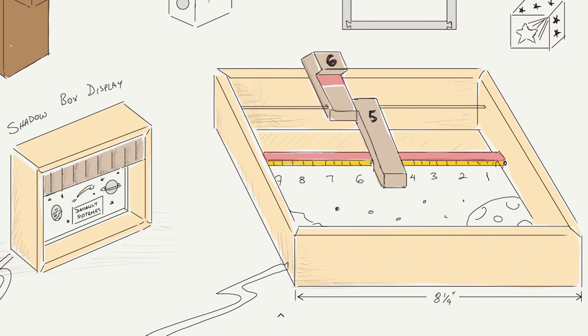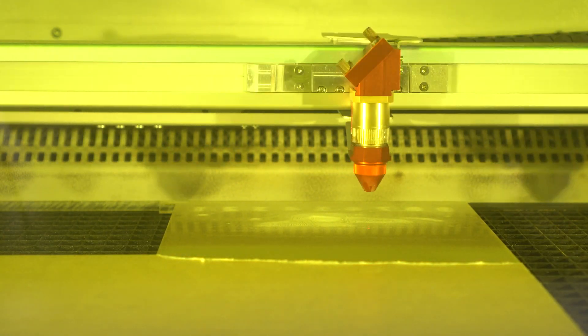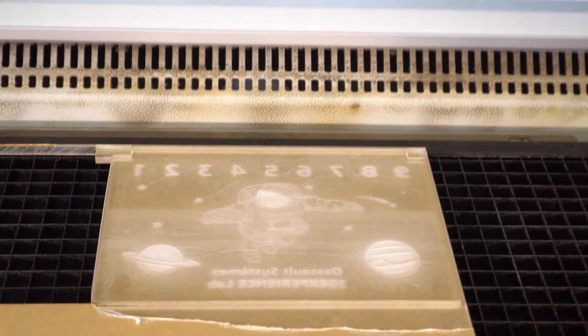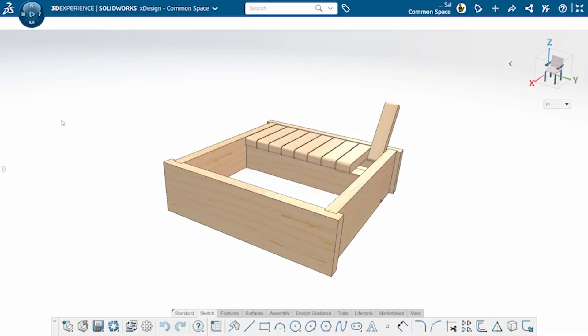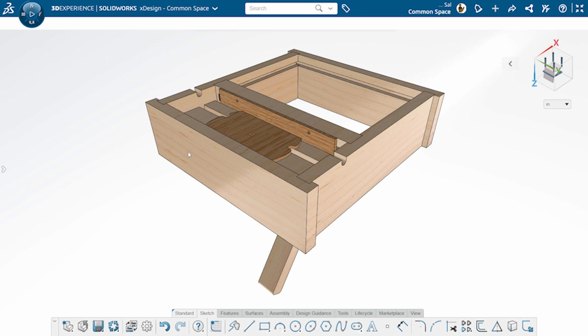For the floor of the box, we thought it would be cool to have something interesting to look at while you play and when it's on display — it could behave like a framed illuminated picture. We came up with the idea of engraving a space-inspired scene on clear acrylic and piping light through it to accentuate the design. I also ordered the numbers in reverse to count down from 9, just like you would if you were to blast off. To keep the design clean, I flipped the image and engraved the bottom side of the acrylic. To finish off on the laser, I nested and cut out the necessary LED backer boards with some engraved reference lines for proper alignment of the LEDs. I also cut out a set of ⅛ inch plates that will be used to hold the USB cord securely in the strain relief channel.